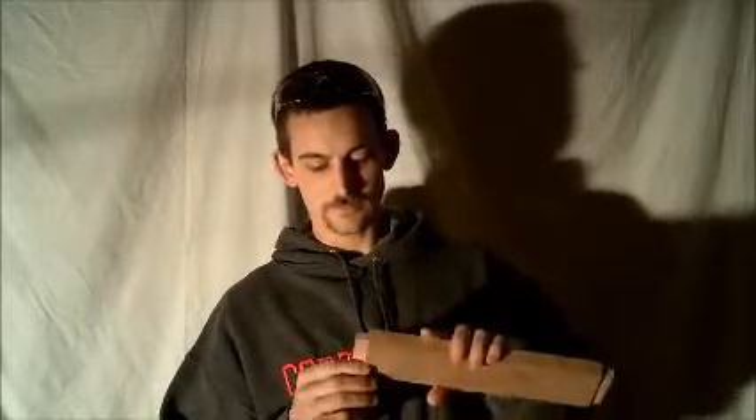You might have some questions — why do you have to have it smooth, and what's the best technique? That's all personal preference and money. Better dado blades would cut a little bit smoother and wouldn't leave as deep grooves. Or you could use a hand plane to take it right off. The chisel is small but it's quick work. A three-quarter inch chisel would shave the whole thing right off. But why do you need a smooth tenon?